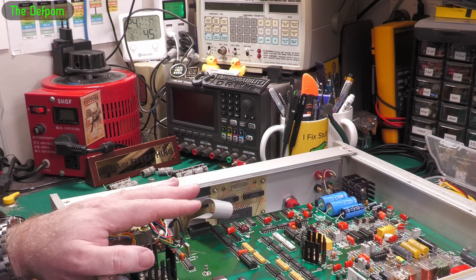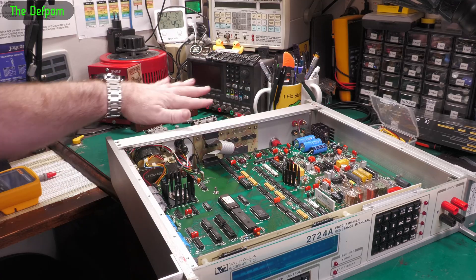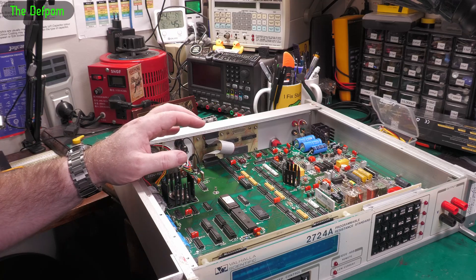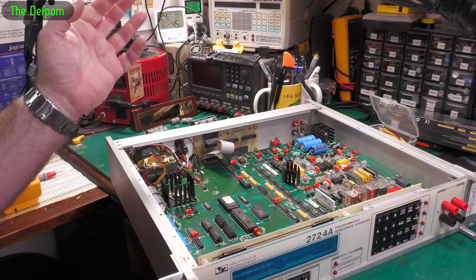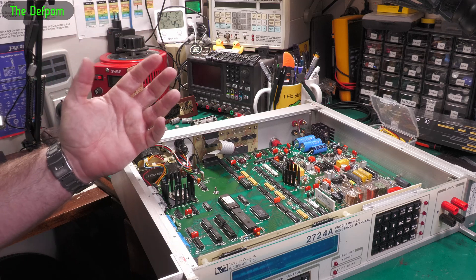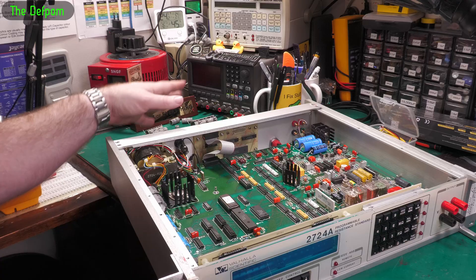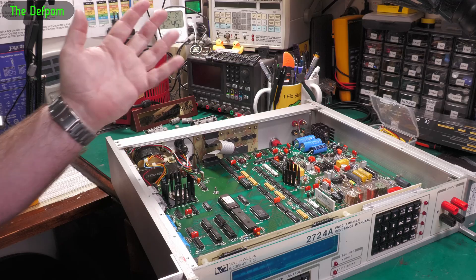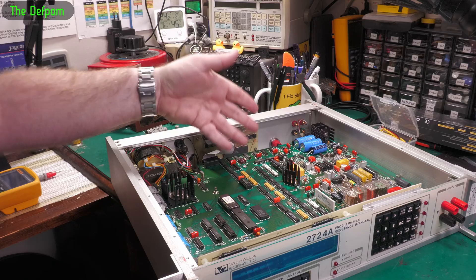Hook up the LC-102 there - we'll check the caps to see if any were actually bad or not. These are good brands, so they could be fine, but are they still going to be fine next year? That's the reason. Originally I was on the fence about whether to replace them, because in circuit they seemed to be okay. In a way it's a shame to waste caps which are perfectly good. But are they still going to be good in a year's time? Are they going to start leaking all over the board and ruining the board when it's sitting there unused? I might only turn it on once every few months. I don't want to have the risk of having one of these caps leak and damage the circuit board, which is why I've basically done this as a preventative measure. They could be fine for another 10 years, but at least now I know they're definitely going to be fine for another 10 years.